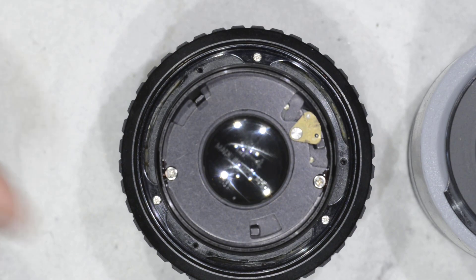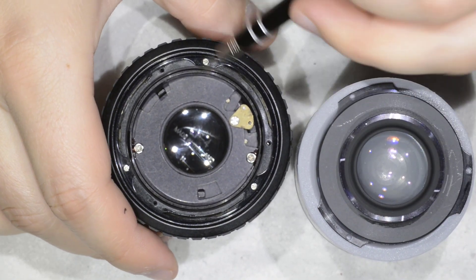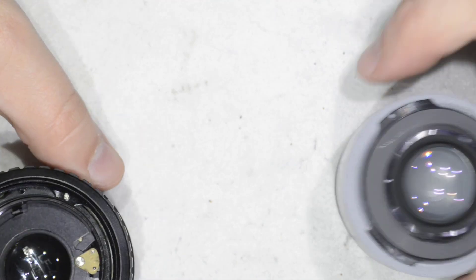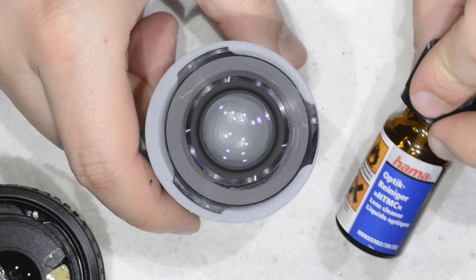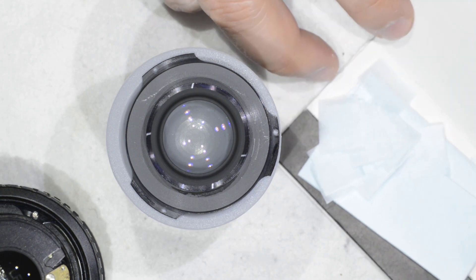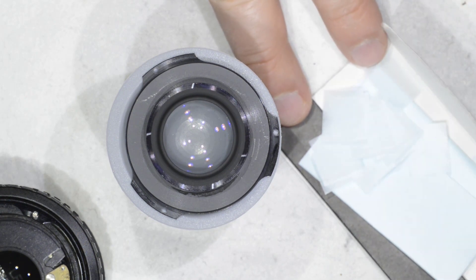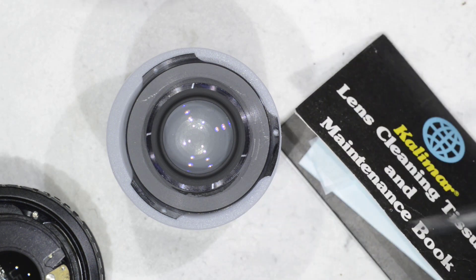You don't need to worry too much because these cleaning fluids are mostly based on alcohol so they will evaporate eventually — but if you can avoid it, it is obviously better. So: we get our lens, then the cleaning supplies — lens cleaning fluid, optical cleaning paper that I cut into small squares to save paper. I left links in the description for other paper that also works, but personally I prefer this one. Then tweezers to handle the cleaning paper.